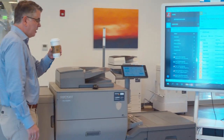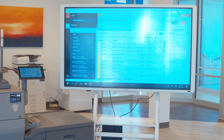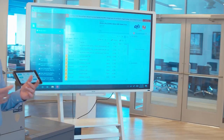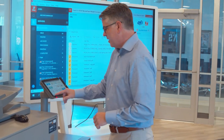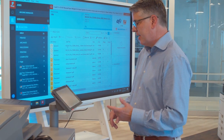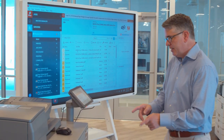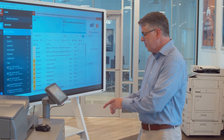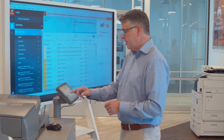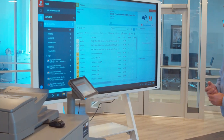The media can keep it on screen after it's done. It's ripping the file — processing it. We have an error. I come over and hit my check status button. It tells me there's an error at the Fiery. The paper has been misassigned, meaning the machine didn't register the paper weight for the 12 by 18 because it hadn't been saved yet. This is easily fixed — I just manually tell it which tray to pull from. There we go.